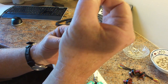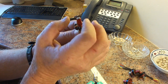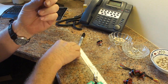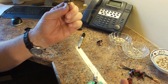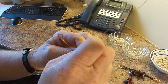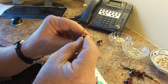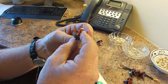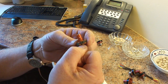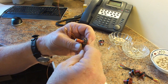By the way, the long lead is going to go to the electronic speed control, and the short leads are all going to be tied together. So let's start phase B — I've cut off another wire, and I'm going to loop it over the 4-40 screw through the middle of the motor. We're going to start with little 'b', going in the same direction, always clockwise.